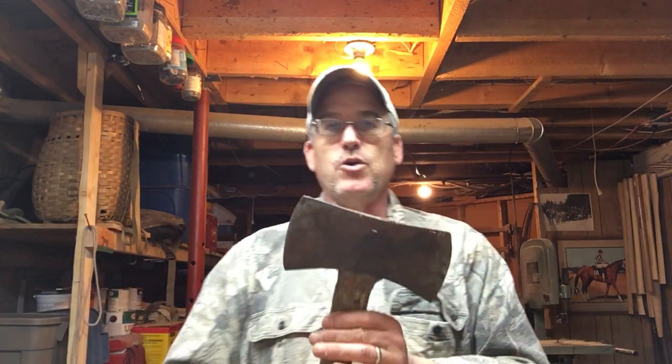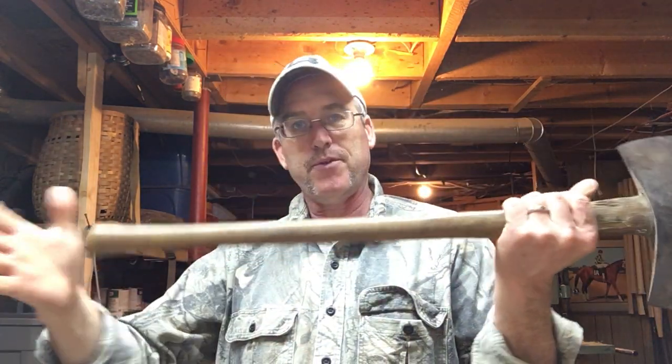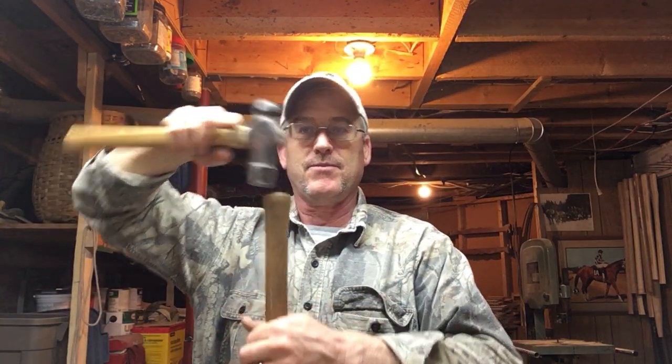So that's about fixing a loose axe head. The best thing to do is to re-wedge. Now some guys will pound the axe head on a little bit farther — they'll tap the bottom of it. And if you ever want to tighten up an axe head, you don't pound it from the other end, you actually just tap the bottom, and that'll pull it up really nice. You can see what I did to this one here — it snugged it up.